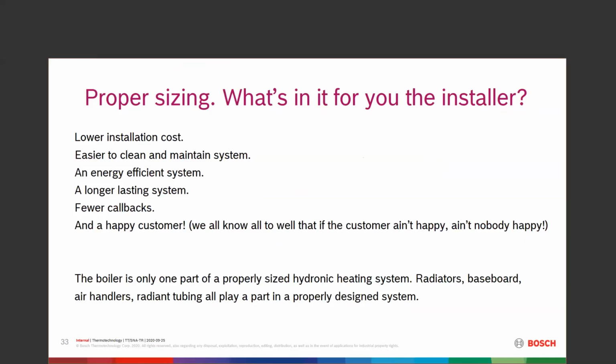And then they came along and did a few upgrades of some windows. They put in some double pane windows or added some storm windows to the house, something like that. And then a few more years, the boiler crapped out, and somebody said, "Oh, 200,000, that's a pretty big boiler, but I don't want to be undersized, so I'm gonna put a bigger one in." So he went to 230.